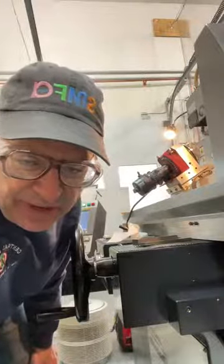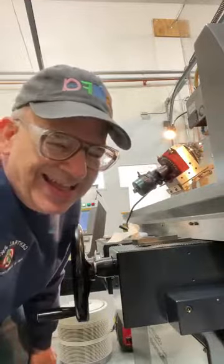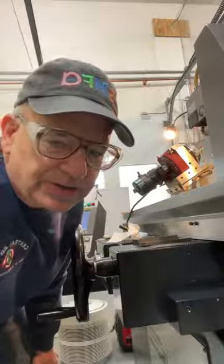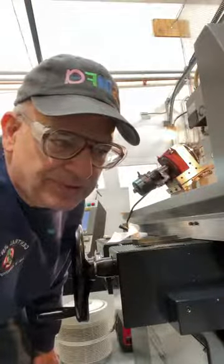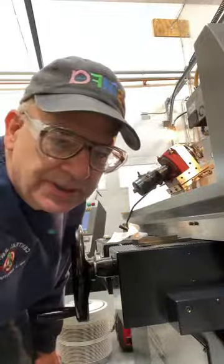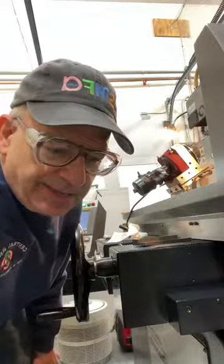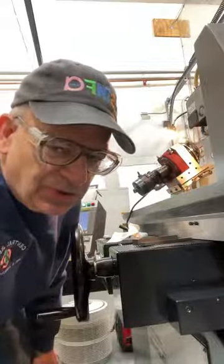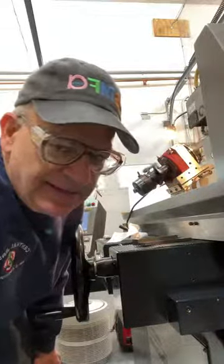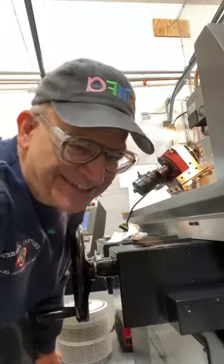Henry says, how do you like Fanuc? I've only heard and read it would be pretty unintuitive to program. It's unintuitive to program, but once you learn a Fanuc control, you've learned all Fanuc controls. My mill, my Sharp mill, has a Fanuc control on it, so I was pretty used to it. It's a good control as far as being bulletproof and getting the job done, but in the user friendliness department, it's not too good.